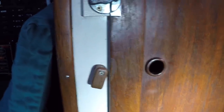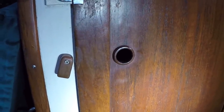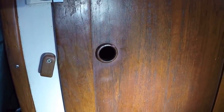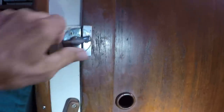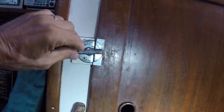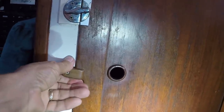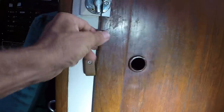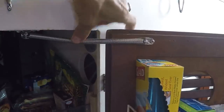One thing I changed very quickly on this boat were these little finger holes with the latch behind. I could only imagine my finger breaking out in the middle of an ocean — and in fact, a commenter on one of the earlier galley tips videos said that's exactly what happened to him. He was reaching in to unlatch the door, the boat hit a wave, and his finger broke 90 degrees. In anticipation of something like that happening, I did away with those latches and installed these twist-lock latches. I'm actually surprised they've lasted over 12 years now — this is 2019. As a backup, we have a little latch down here, and in rough weather when things might be slamming against the door, we always put on these extra security latches. At the top of the door are these springs to help hold it open, especially in rough weather — so the door won't close unless you push it.